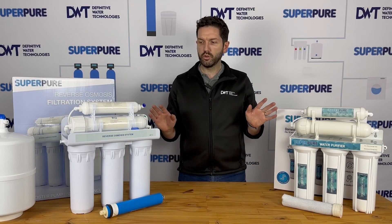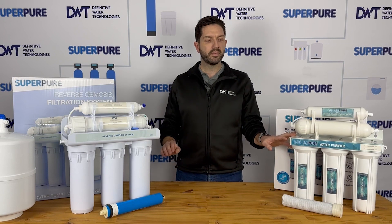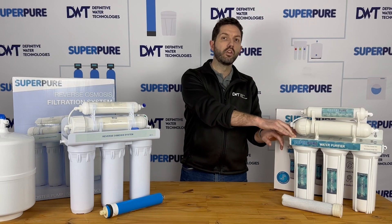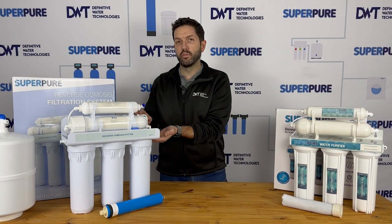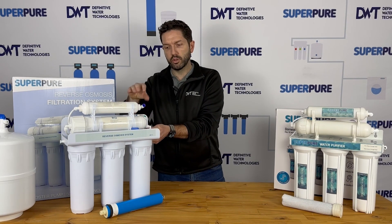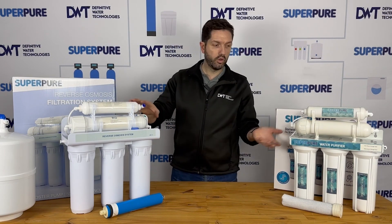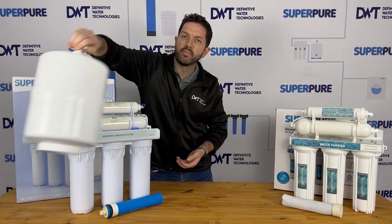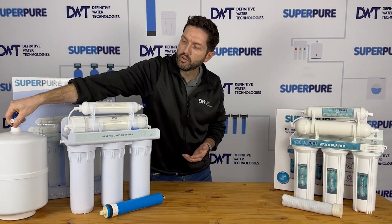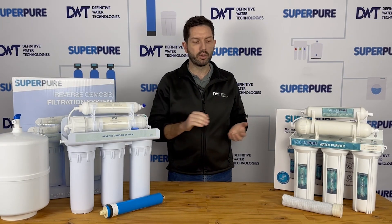The biggest difference between the two: firstly, an ultra filtration unit tends to be a little bit cheaper, a little more compact, and with the ultra filtration unit you'll have no water waste. A reverse osmosis unit offers better filtration, however it does waste quite a lot of water. As a domestic system it also takes up a little bit more space, because even though the units are similarly sized, you would tend to have a buffer tank, because the system runs through quite slowly — that makes sure you have enough water if you want to open a tap and fill up a glass.